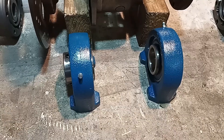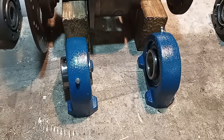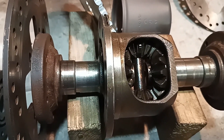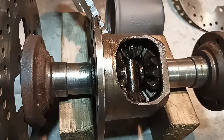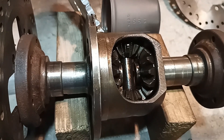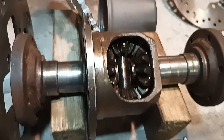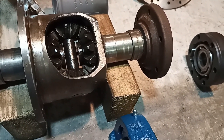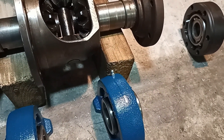There will be some machining required to get these 40mm plumber's blocks to fit the bearing area on the diff. The bearing area on the diff is about 41mm, slightly larger on the crown wheel side than the other side, so I have to machine that down to a location fit. The stub shafts also need to be machined down to a sliding fit, because they will in fact tuck into the plumber's block slightly.